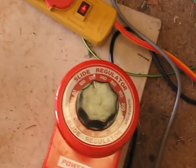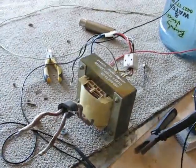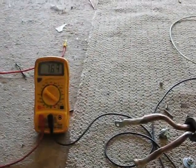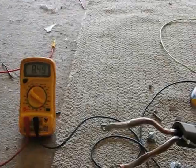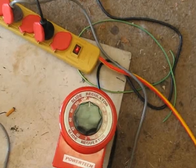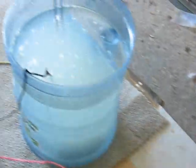That's running at 120 volts through the 8XA cell circuit from Tony Woodside, and running through that coil I got out of my power-ups unit. I'm running at 7 amps there. I'll take it up to about 8 amps — maybe 9. Now I'm up to 9 amps. There's no electrolyte in the water either. I'm at 140 volts on the variac now, and that's the gas I'm getting out of it.